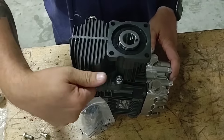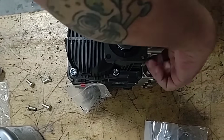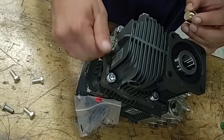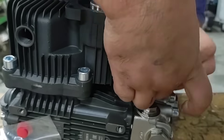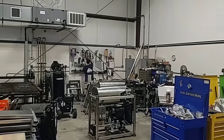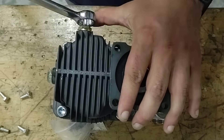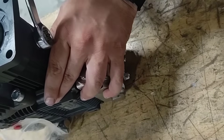On this step I like to remove the drain plugs. I'm removing the top one — we don't need it up there. I'm going to tighten the bottom one by hand. Remove the sight glass from the stock side; it comes on this side but we want it on the outside so both the pump sight glass and the gearbox sight glass are on the same side. With these, being that they have an O-ring, they do not need to be extremely tight. The brass plugs are a 17-millimeter wrench — just snug. You have an O-ring in there; if you over-tighten it, you're going to crush it.